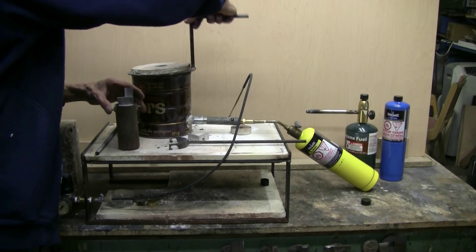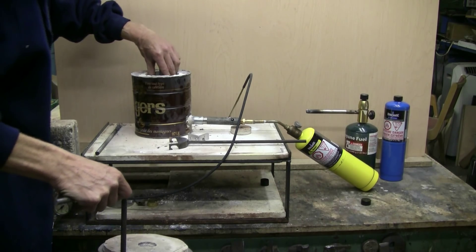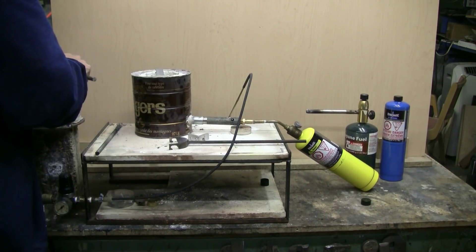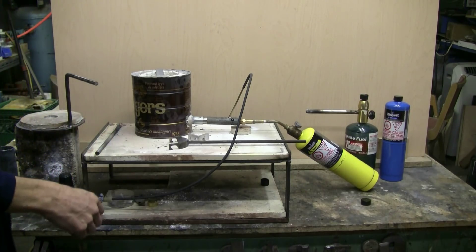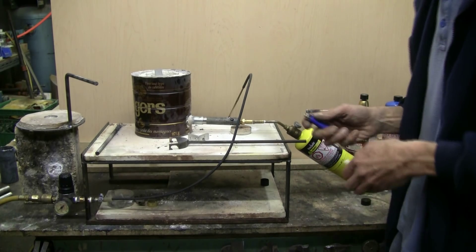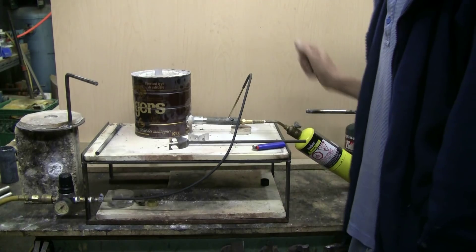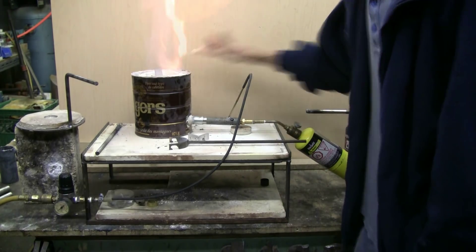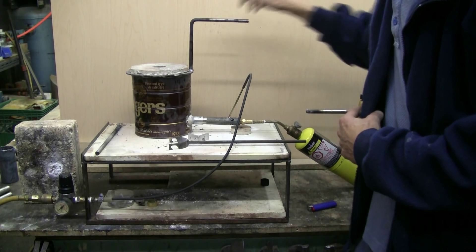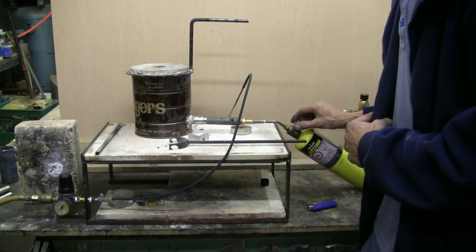I have it in the crucible. I'll lift the lid off the furnace, which is cold, so I can put the crucible in by hand. The lid fits. So what we'll do is turn on the gas a wee bit, light a piece of paper here. There we go, finally lit. So we can put the lid on and slowly turn up the gas.